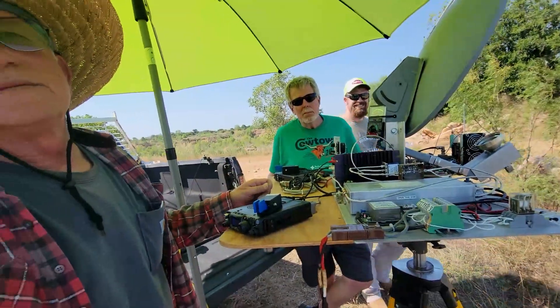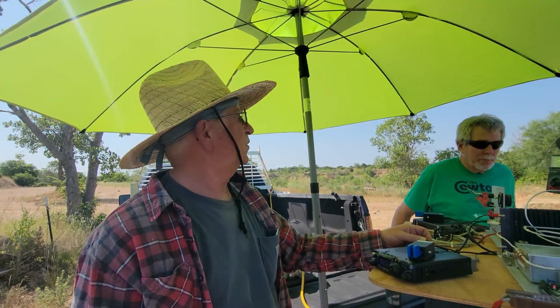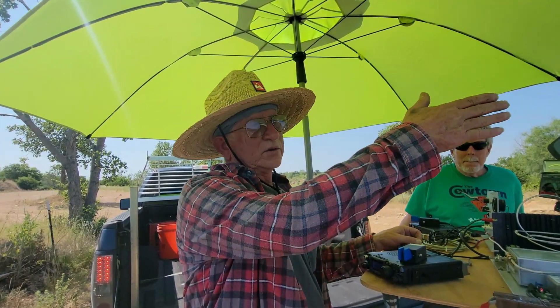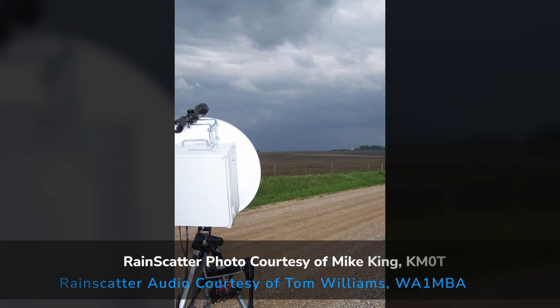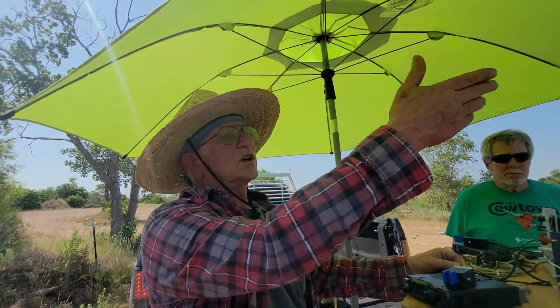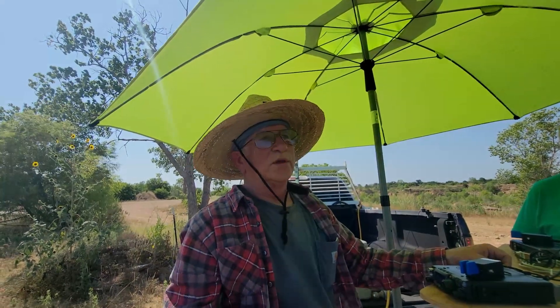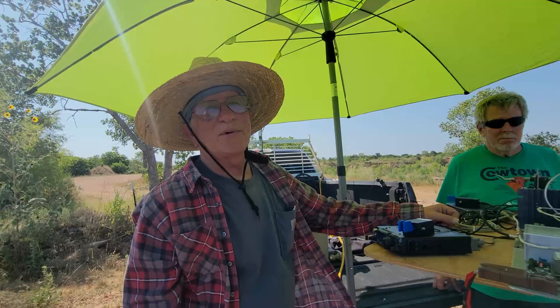Do you typically do CW for these contacts? Almost all of ours have been CW. We've done a few sideband ones when we get close. Rain scatter — unfortunately we don't have any rain today, but you heard the raspy signal. That's humidity causing that; rain is even more pronounced. It sounds like aurora — a buzz, like shh shh shh. That's what you get with rain scatter, but it extends your distances. If you catch a rain cell in the right spot, Scott, AA5AM, with less than a watt, worked N0OI in southern Kansas on rain scatter. So it's all timing and being in the right place at the right time.